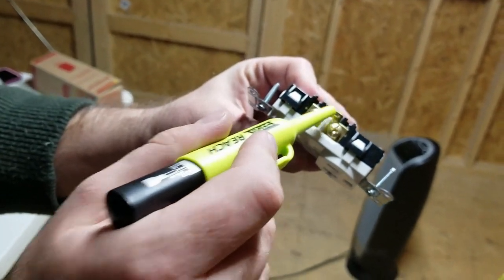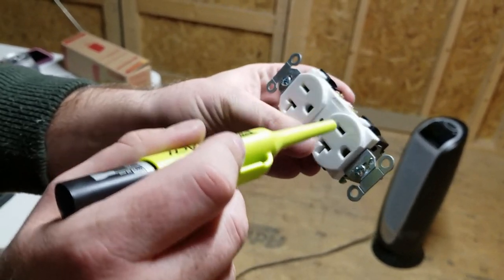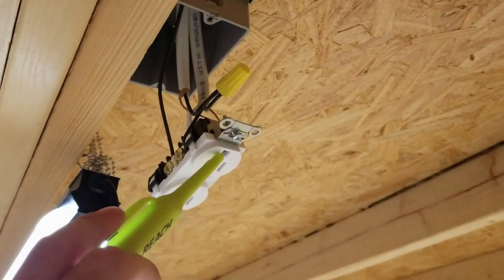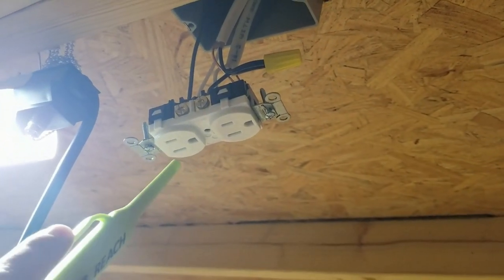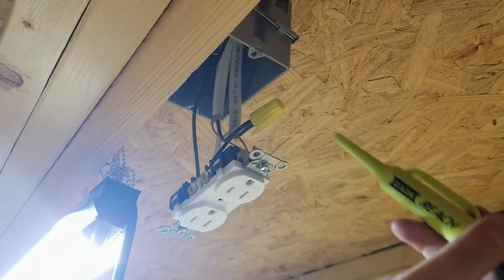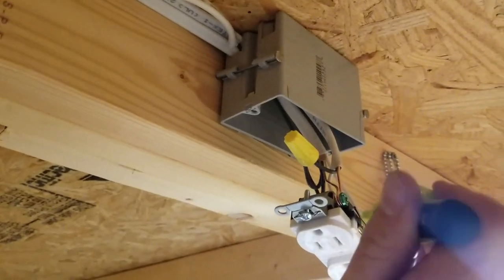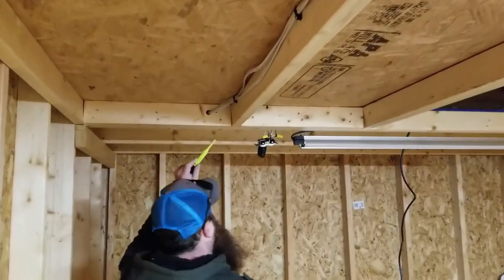If you take a look at this receptacle, there's a little piece of copper connecting the two outlets — we've snapped that off to separate the power to these two plugs. The reason we've done that is now this wire has direct power, so this outlet is always under power, while this one is not — we've wired that to a switch. We have another wire run into a second outlet; that's the third black wire you see here. Its ground is grounded out and its common is ran right here. We've left that little flange there so a continuous connection can be had.